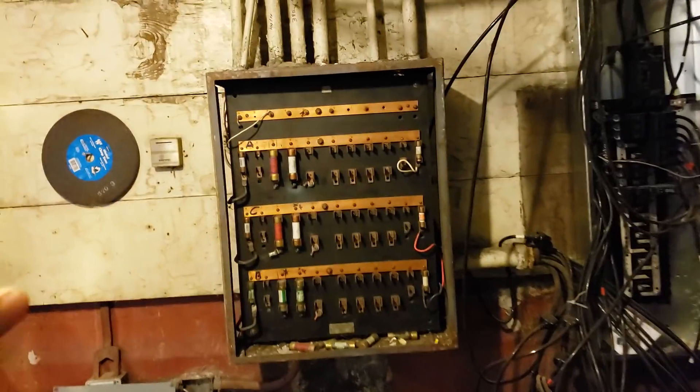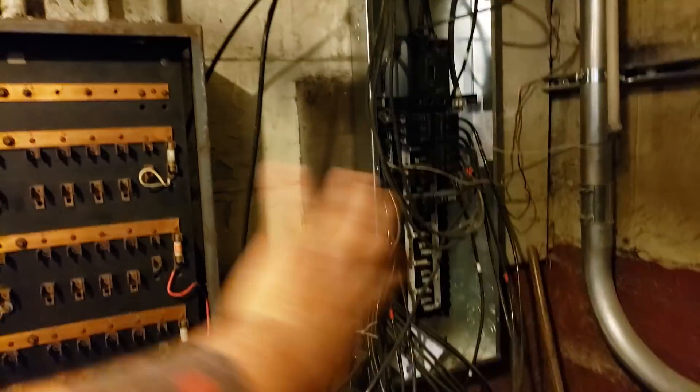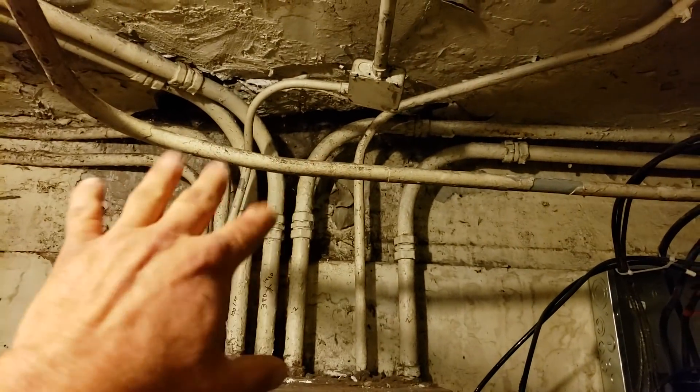It'll be three-phase for the building panel. There are only a couple of lighting circuits and maybe some convenience outlets on that building panel. This whole building was metered with one meter when I got here. They're expanding their wood shop, doing more stuff, and the building next door burned down — so the owner finally said, yeah, let's do it. All this was just racked together, and I'm having to temp them in to keep power on.